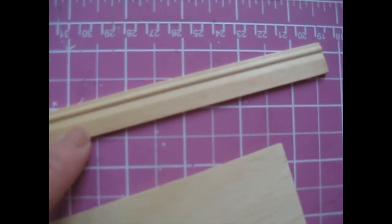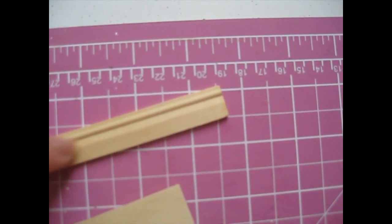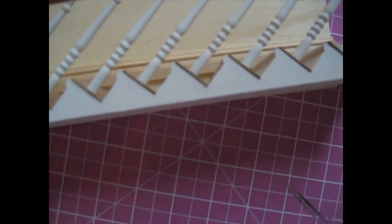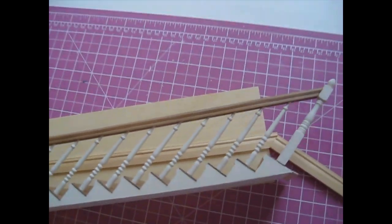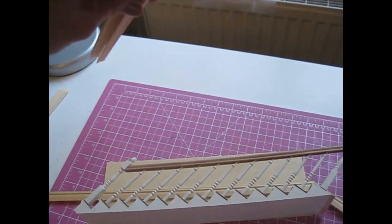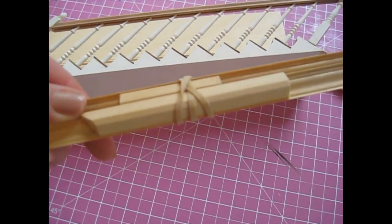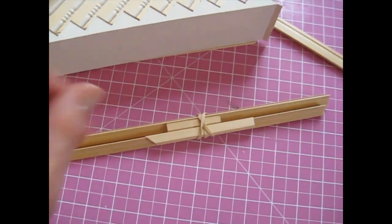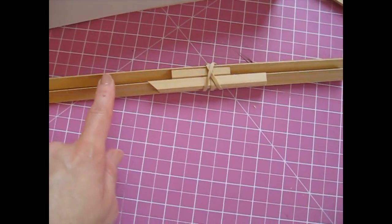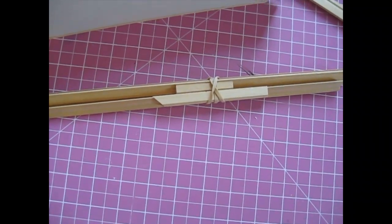Along the front here it will be cut so it goes up straight with that first stair there. I'll have to get an exact measurement and cut it along underneath that piece of skirting. To have that nice moulding so it all looks uniform, I'm going to cut this top part of the skirting. You can see you've got a flat bit at the bottom and then that lovely design, so I'll cut this flat bit off and then I can use that top part at the top of the stringer. I'll start by trimming off this skirting — I've got plenty of it. What I did just realise though is that I haven't got much coving left, so I won't be able to do the whole of the coving for all areas in this episode — I'll order some more in for the next episode.